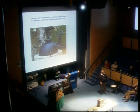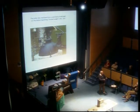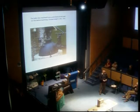But the way I did it, I got the outside profile at about 8 millimetre centres, all the way from there to there. I drilled holes precisely 5 millimetres deep all the way around. And when I was turning blind, when I broke into one of those holes, I knew I was right. And that's how I did it, all the way around. So it took a long, long time to do that. And then, of course, when I'd finished it, I just filled the holes in. And just for a bit of bravado, I think, it has been tested to about 200 PSI.